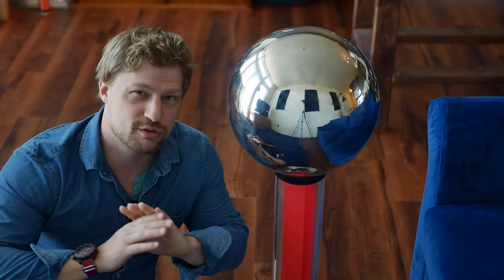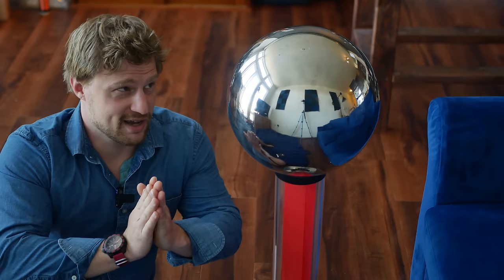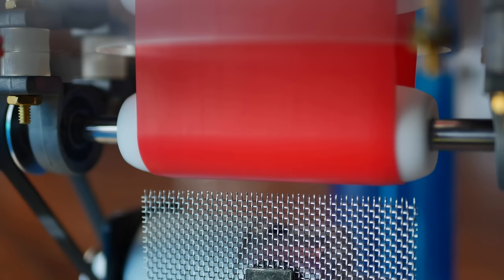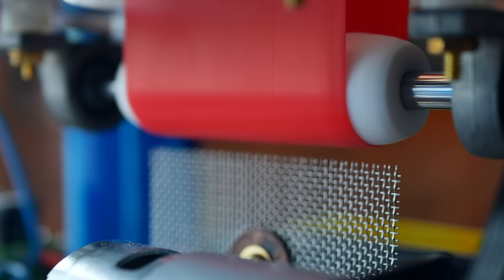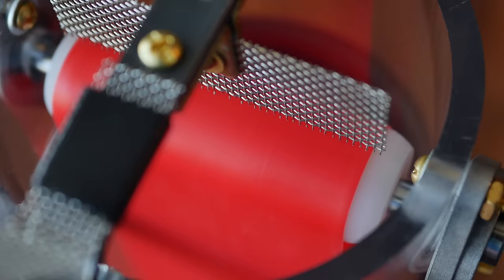All these crazy effects are made possible by the triboelectric effect — it's what makes Van de Graaff generators tick. The triboelectric effect is the creation of electric charge through the contact of two different materials, and these generators are engineered to take advantage of that. The lower roller is made of nylon; after contacting the rubber belt, it becomes positively charged, attracting electrons from the ground brush — but since the belt is in the way, electrons are sprayed onto the belt instead. The belt cycles up and contacts the upper Teflon roller, which develops a negative charge, repelling electrons toward the brush. The upper comb then collects these charges and deposits them onto the sphere.